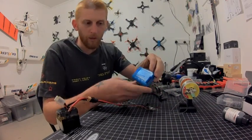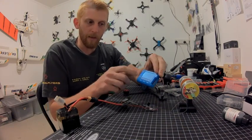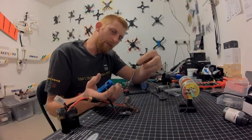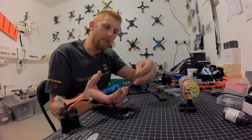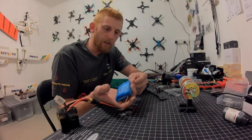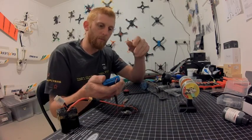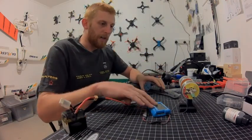It's powered up now. To get into PPM mode, hold the button and it comes up with PPM — it starts at the minimum, 500 microseconds. I've got the ESC negative and the PPM signal wire going to the ESC, so I'm putting signal to signal. I don't actually need the earth on this because the ESC is already earthed out through the power distribution board. All sorted.